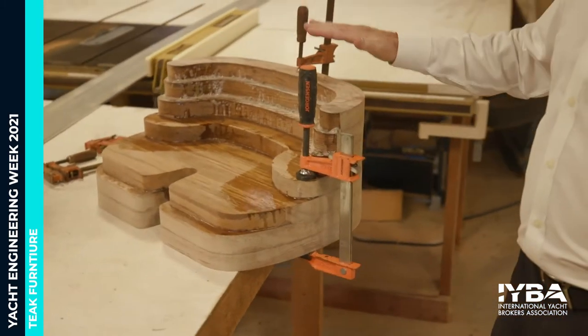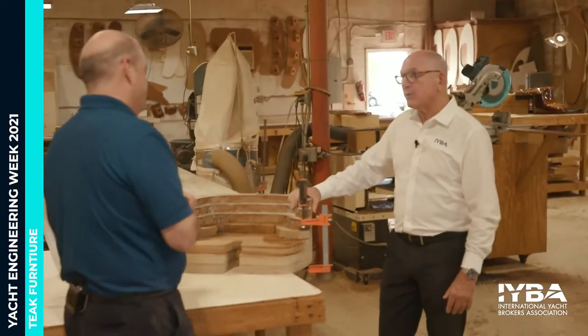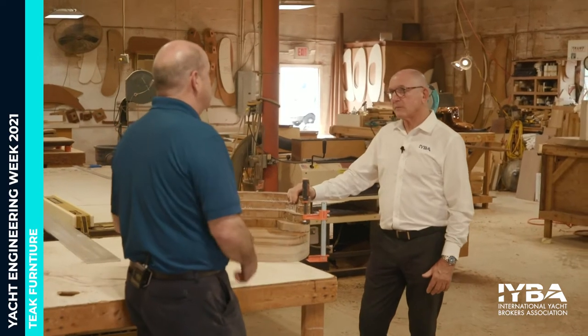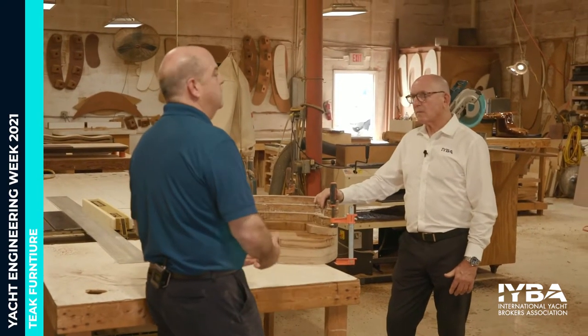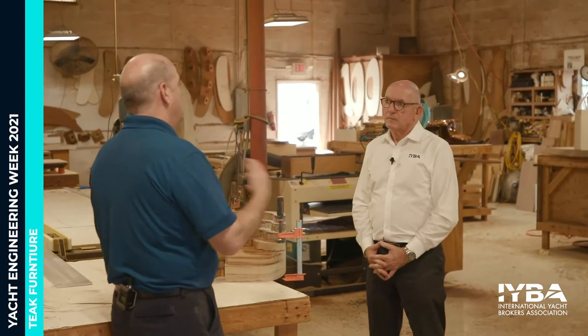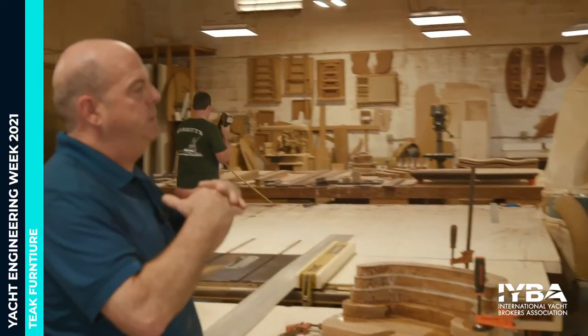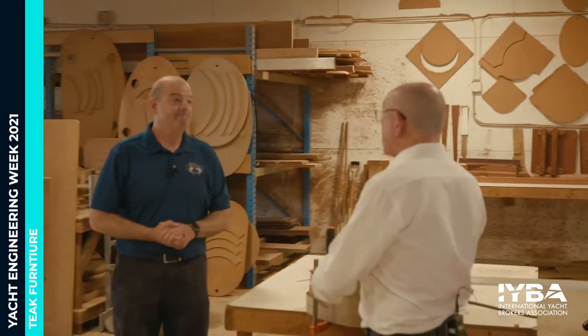This speaks to some of the difficulty of sourcing materials — obviously you couldn't find a piece of teak this thick. In order to do a build-up with as few pieces as possible, we're using six-quarter teak here. We've got seven pieces of six-quarter put together for just that seat part. It does take quite a bit of teak. You also want to make sure when laminating that you're using different graining — if it's just one solid plank, it'll warp. By using two pieces of wood together, they work against each other to control warping. Kind of the premise of plywood on an expanded view.